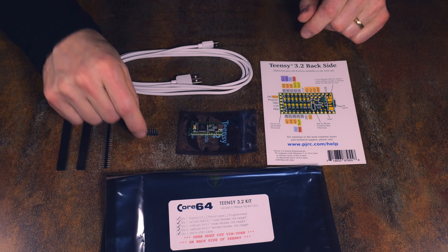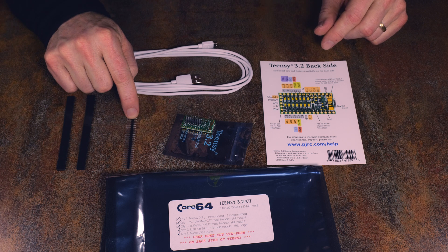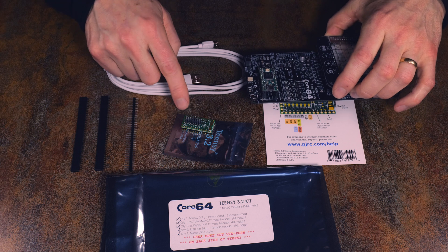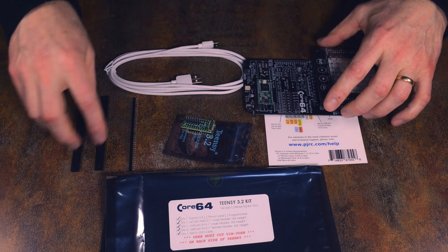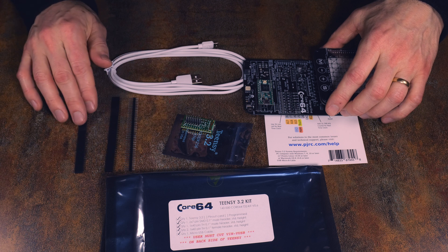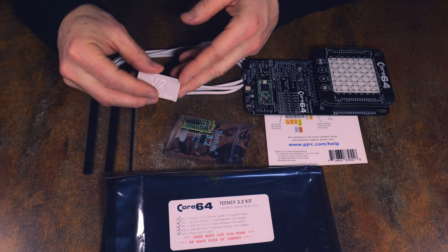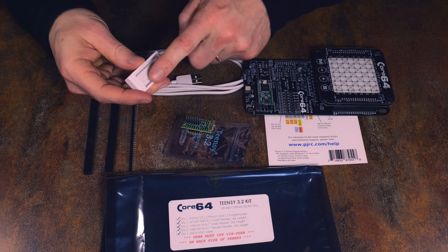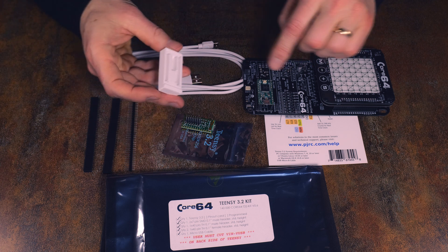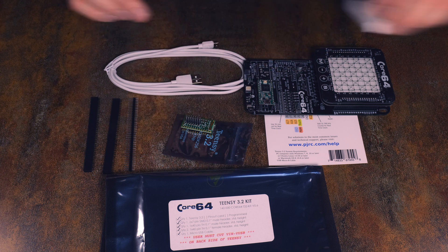There's a two-by-seven male headers row that goes on the bottom, and this row of male headers gets cut and filled in. The sockets are designed to accept the Teensy on the logic board and will be cut and put into position. Alignment is pretty important, so take care to keep things aligned and squared up. There's a link in the instructions for a 3D-printed alignment fixture that allows you to get all the sockets cut to the right size, dropped in, and then it lines up onto the logic board to ensure all those sockets stay in position while you solder everything up.